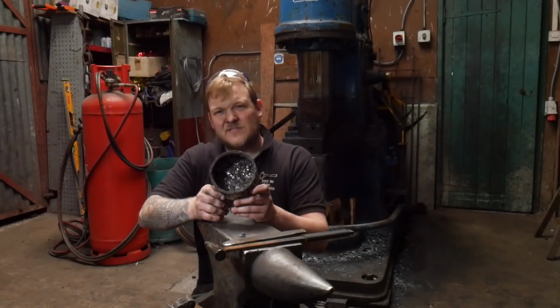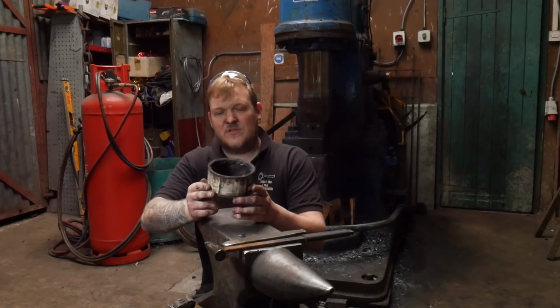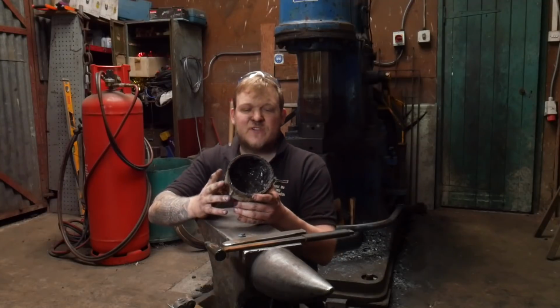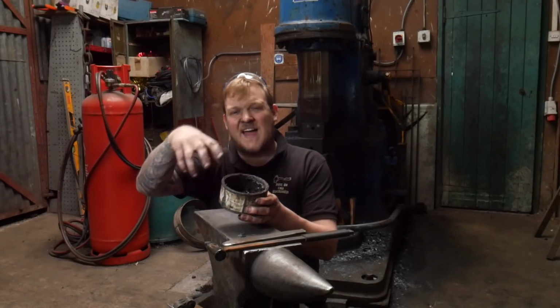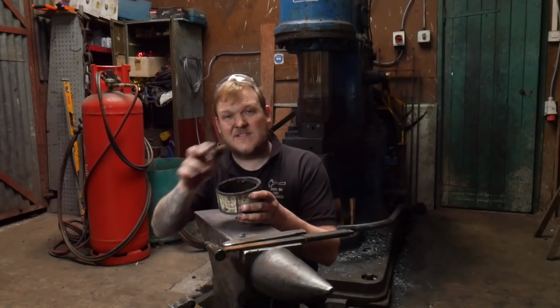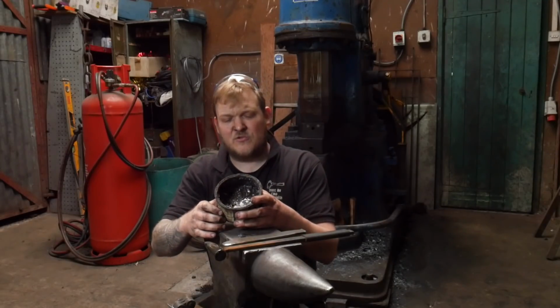And lastly, I get asked a lot about the type of lubrication that I use. In this pot here, it's the last dregs of beeswax with terps in it, or turpentine, mineral spirits. So there was a little bit of that in the bottom, and then basically I added linseed oil and mixed those together until they all sort of come together. And then I get graphite paste.